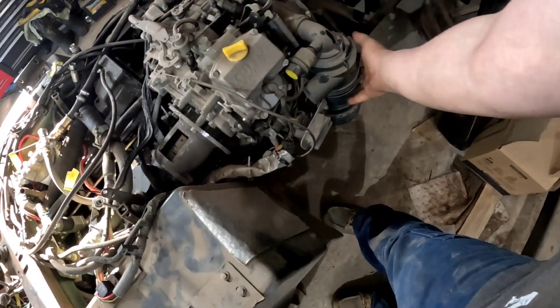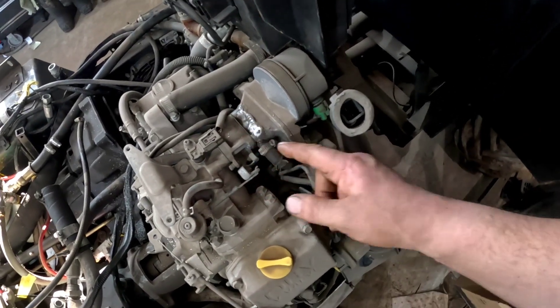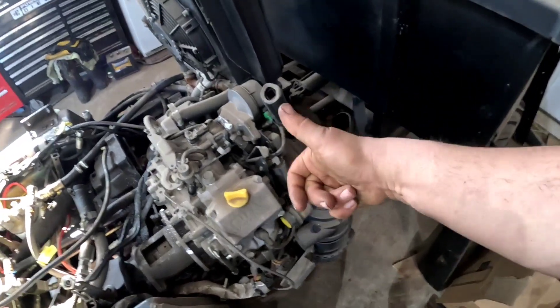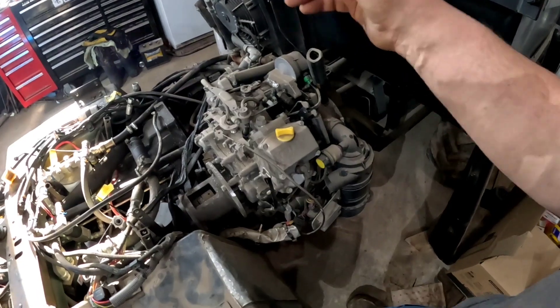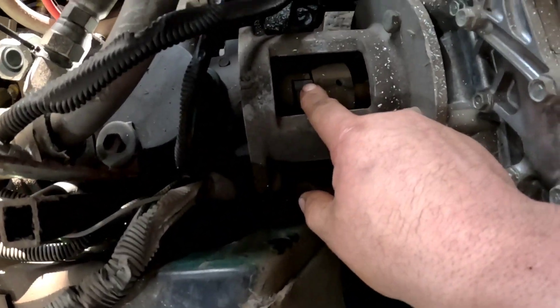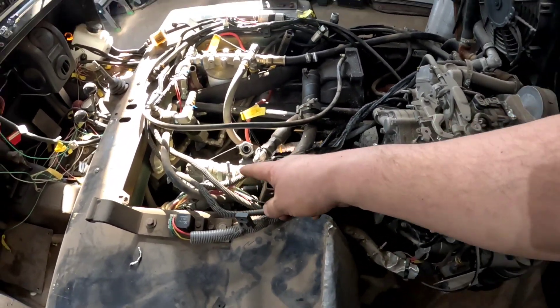That's the cooler intake on it. Somebody has cut the air intake and modified it to shorten it up and adapt it to a different air intake — which is questionable at best. It is coupled, via a Lovejoy coupler — you can see the Lovejoy coupler in there — to a hydraulic pump and hydrostat drive.